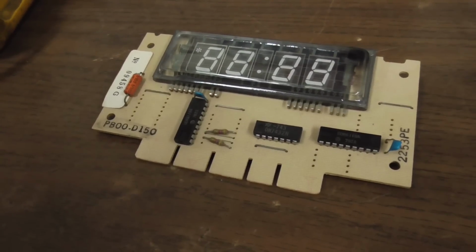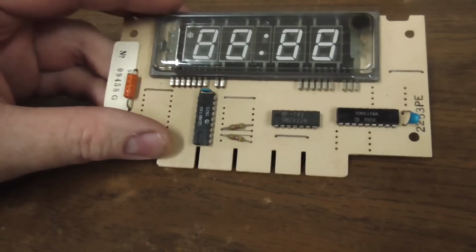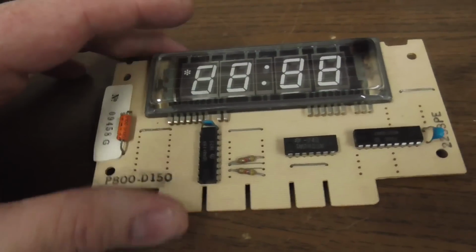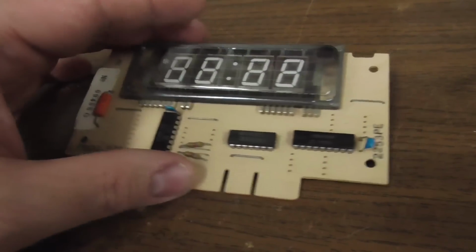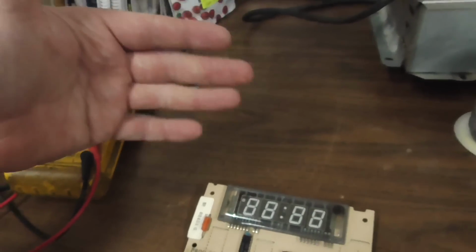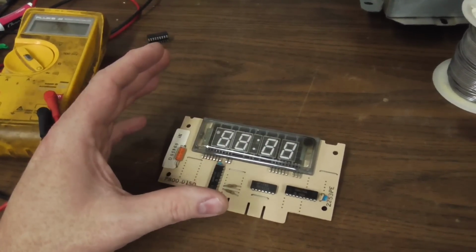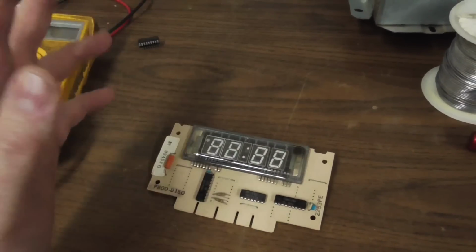Okay, so the whole time that we've been playing this thing, this digit is locked on. This is the status display down at the bottom. And the way these work is they have these little chips that say UDN6118 that make it all happen, right? So this one handles the segments. There's also a 7432. I don't really know what it does. And this one handles the digits. So the MPU sends out a strobe on all of the digits, and so there's these 4, and then there's 6 on 4 other displays, so there's 28 different digits, right? And it's all strobed, so with some other control line, it tells it whatever.